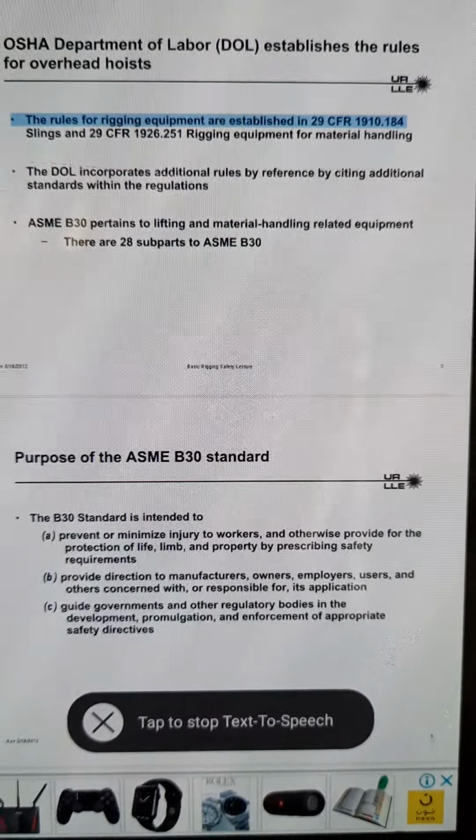Lecture 26. Hoist rings. Lecture 27. Swivel hoist rings are able to accommodate various use angles. Load ratings are based on size, ring size and thread size. Material is commonly alloy steel or stainless steel. Thread length: longer lengths are usually designed for soft metals such as aluminum. Shorter lengths can be used in ferrous metals such as steel.